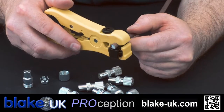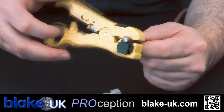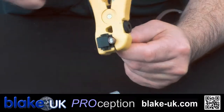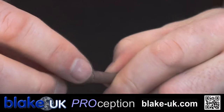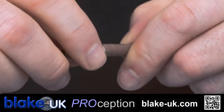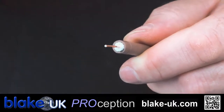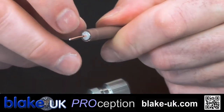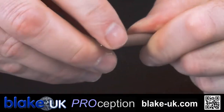Put your coax into the tool like so — it fits flush with the black piece there. Give it a twist, you'll hear it cutting the cable as you do, then put that down away. Be very careful when you pull off these pieces — that's the first piece that it's cut. That leaves you with this; there's a second cut there, be very careful on peeling that away.